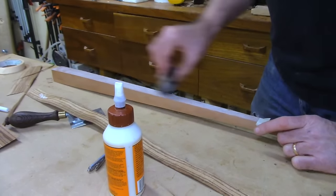Steve's curious about that short piece at the end because of a change in grain direction — can you explain what that was about? These legs are tapered. One surface — the outside corners are true, the inside surfaces are tapered — it's only tapered on two sides. So these start out flat and then the taper runs down. If I put a flat caul on here, I wouldn't have been putting pressure at that top. So I put a small piece on the top and then another piece below. If you have an uneven surface like that, you have to get creative if you're clamping. However, with the iron-on you can go right over that and not even worry — that's one advantage of ironing.